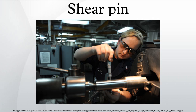In the role of a mechanical safeguard, a shear pin is a safety device designed to shear in the case of a mechanical overload, preventing other, more expensive parts from being damaged. As a mechanical sacrificial part, it is analogous to an electric fuse. They are most commonly used in drive trains, such as a snowblower's auger or the propellers attached to marine engines.